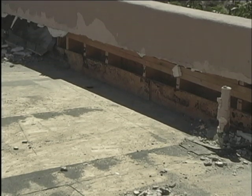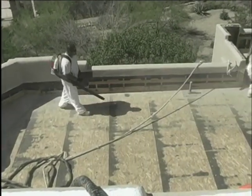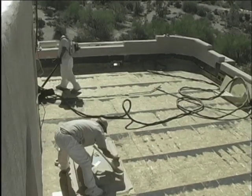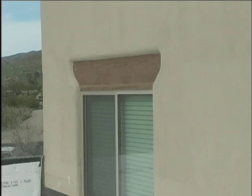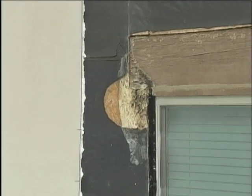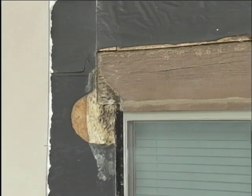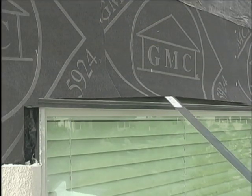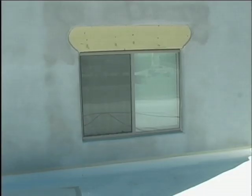In Tom and Jan's case, you can see there are many voids in the paper that's behind the stucco. By the way, if you have any wood penetrating your stucco walls in stick frame construction, that creates a void in the paper and that too will cause leaks. Or if you're experiencing leaks around windows, usually the flashings around the window frame are improperly installed, creating yet another void and another way for water to work its way inside your home or building.